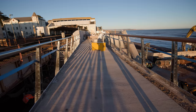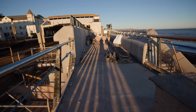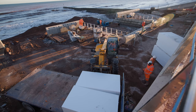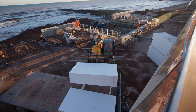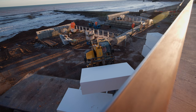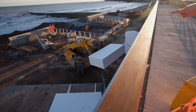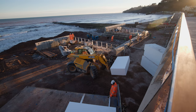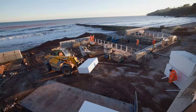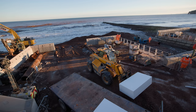As you walk over into Section B you can either carry on down into Dawlish or go back down the stairs into the stilling basin area. You can see the two communal areas from up at the top. It's looking a lot more vast now that all the equipment and framing is out. The wire strands for the stainless steel fencing system also run through the stilling basin. The middle supports you can see at the moment are temporary — required to prevent falls while we're working — and then the last structural thing to do on this side of the basin is to close that section of the seawall, which we can't do yet because we're still building the eel ramp at the bottom.